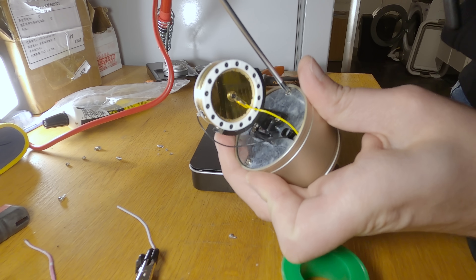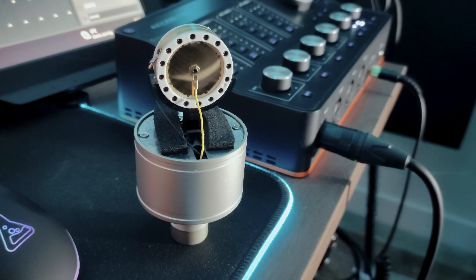The next few days I put the mic through its paces and I did notice some issues. When the microphone is very close to my mobile phone, it can sometimes pick up GSM noise — it might be that the circuit board does not protect enough against that, but as long as you keep some distance from your phone it doesn't really have to be a problem. I also noticed that the vocals had a bit of a metallic sound, so I opened up the mic again and noticed the plate below the saddle was not screwed on tight enough. I increased the tension a little, which reduced the metallic ring — so definitely make sure it's screwed on tightly if you attempt this yourself. I also added some open cell foam on top of that plate to dampen any sound waves that might hit it.